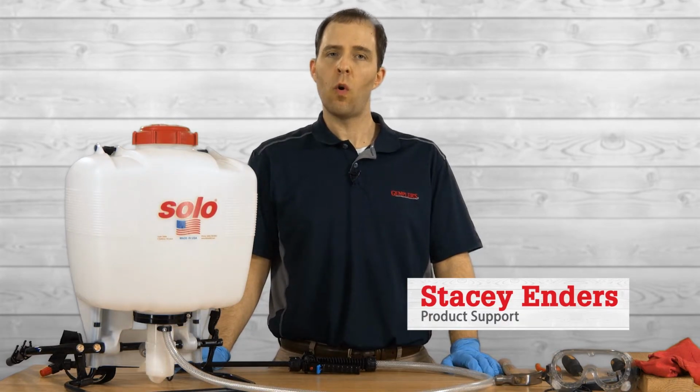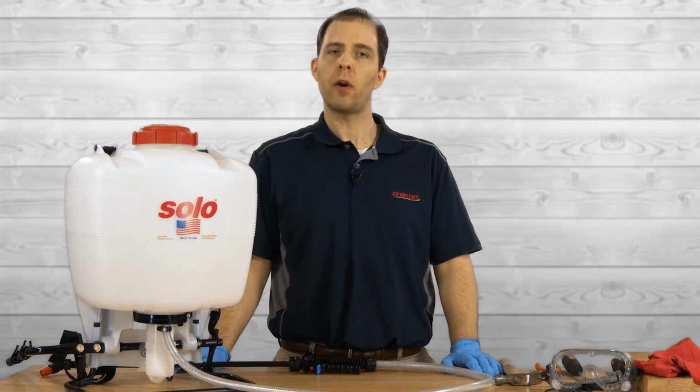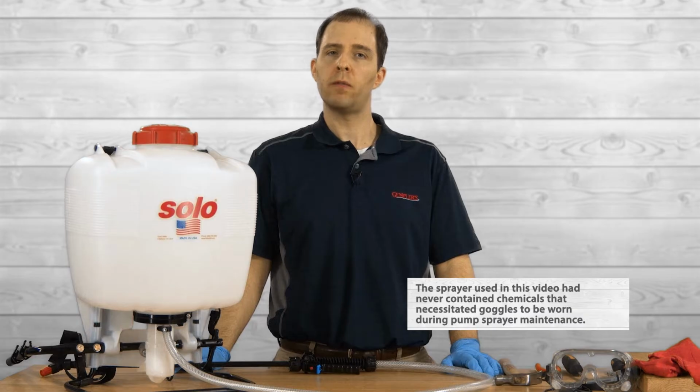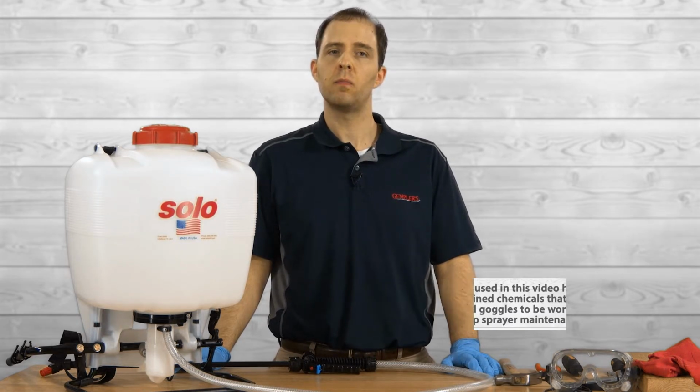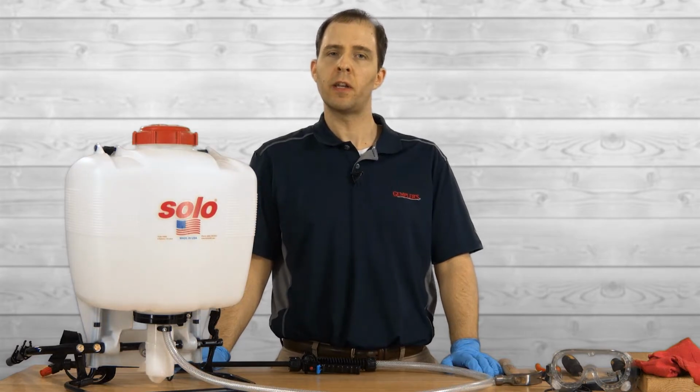In this video, we'll go over how to disassemble and repair a Solo piston pump sprayer using the repair kit. Before you begin, be sure to wear any personal protective equipment required by the pesticide label, such as gloves and goggles. The sprayer should also be flushed with water and pressure should be released. Then, lock the shutoff valve in the open position prior to starting the disassembly.